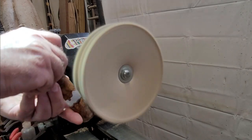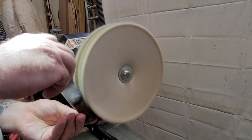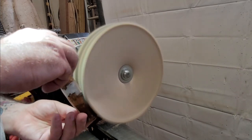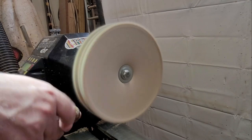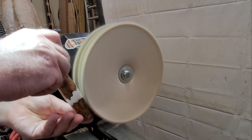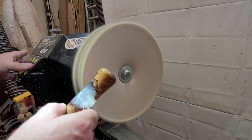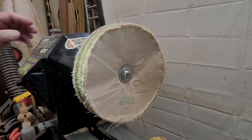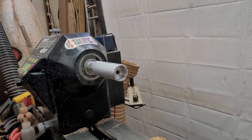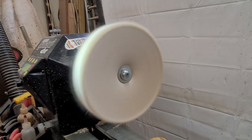I'll show real quick what I use. I typically start off with the Tripoli wheel and Tripoli compound — always keep that piece moving, don't leave it in one place while buffing or you'll burnish the finish. Then I'll move to the white diamond. In this case it didn't give it that much more over the polishing compound since that did really well, but it's a good example of how to take your piece to the next level. Once I did it, I was amazed by the difference and disappointed I hadn't bought a buffing setup sooner.